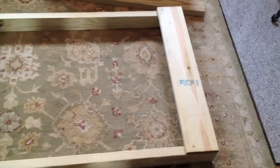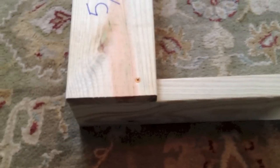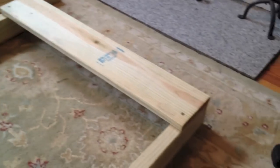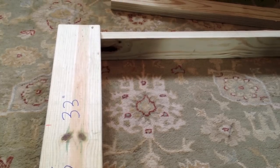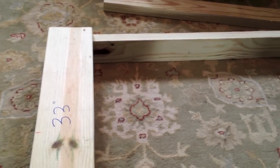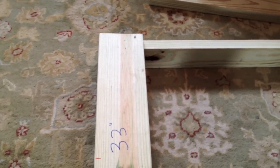We start by beginning on the underside, and we take the two bottom deck pieces and have them straddle the two end edge bearer boards. We're screwing these in with 2-inch deck screws that are corrosion resistant. You'll notice I'm only putting in one screw in each board — that will allow the project to rack a little bit, because we're not going to make it square here. We're going to make it square when we add the plywood decking, which we know will be square based on the factory edges and factory cuts. We'll leave these with just one screw in for now, then finish adding the plywood decking, and come back to add a second or third screw on the underside.